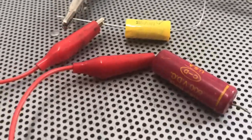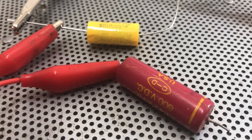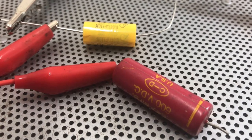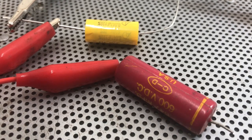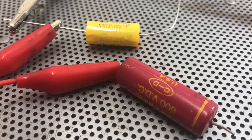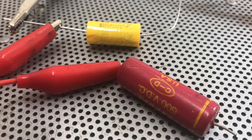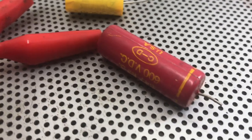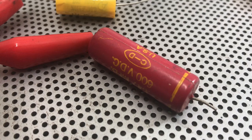So the comparison: the Red Chief self-discharges with nothing hooked to it at all. That capacitor will probably still work in a circuit. However, suppose you're dealing with a very high impedance grid of a vacuum tube in the megaohms. Suppose you're using contact potential bias to bias the device you're trying to feed a signal into, and you've got something that might be leaking at several megaohms. I think you get the drift.